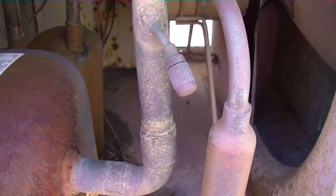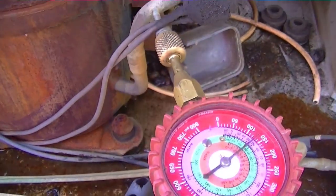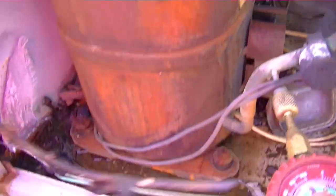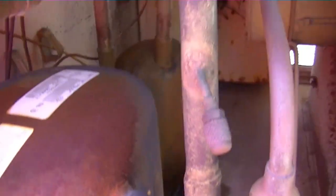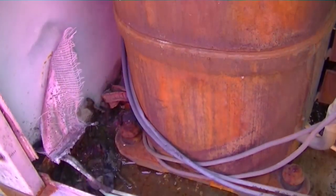Even cleaning the coil could damage it, and it's definitely dirty. The only thing it would take is water, and water would still knock plenty of those fins loose. There's a lot of questionable work taking place here. There's our reversing valve and leads to it — I bet it doesn't work great when the wires don't go anywhere. The crankcase heater wires are disconnected. There are just random wires laying everywhere. And I really love the melted cabinet over there — that's my favorite part. So this instrument of death is going to be cooling for a little bit longer. I'm gonna go meet with the people right now and talk to them about this thing.